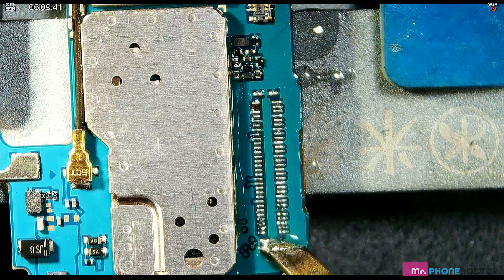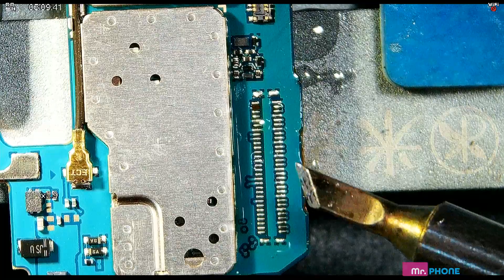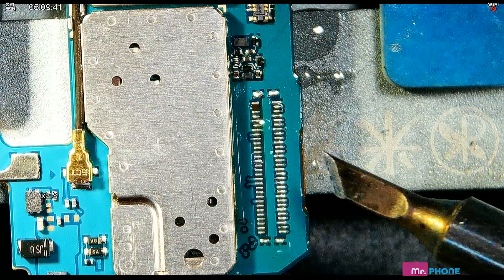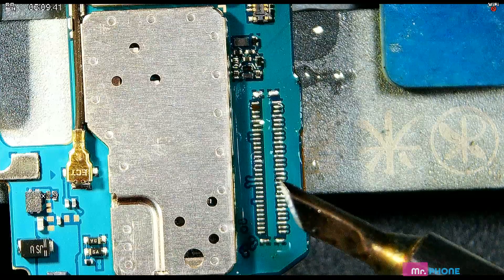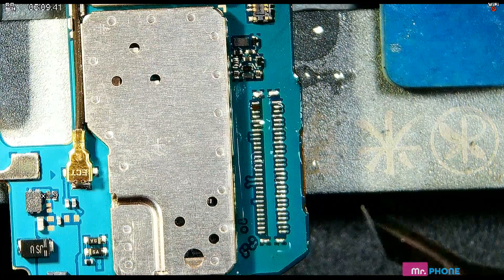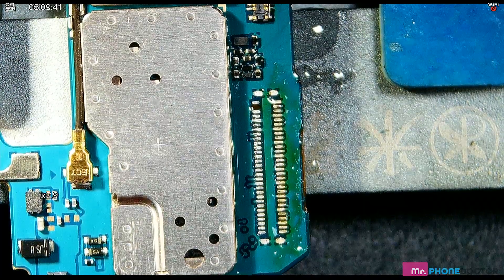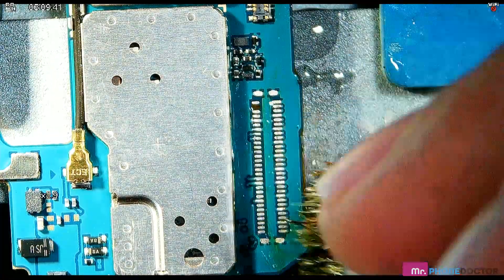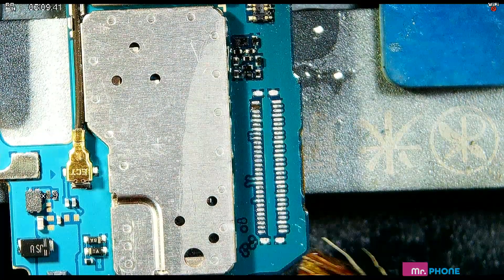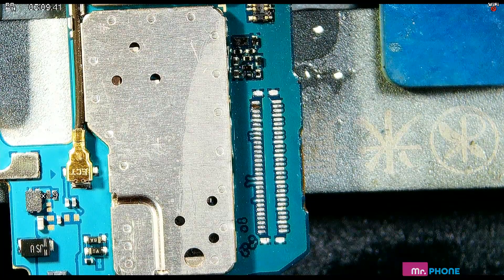Oh, there was a torn pad — look at that. Those can be resolved. I've seen some guys go in with some solder paste, low-temp solder paste, and just go in with hot air at a very slow speed, about 5 or 10, and just press everything in there. You'll see a little brown tarnishing — that's the flux. I recommend going through with a special brush to clean it. But overall, that is a pretty decent removal, minus this pad that got torn.